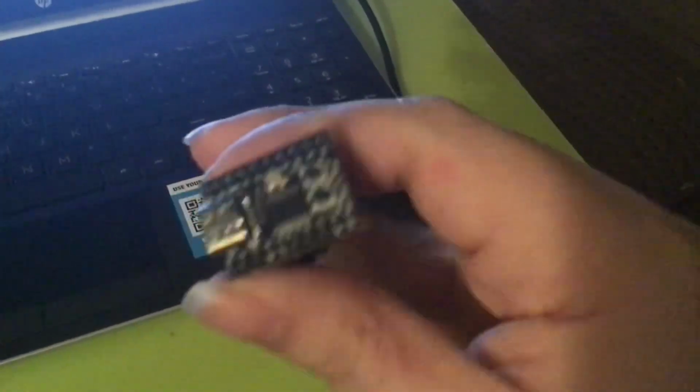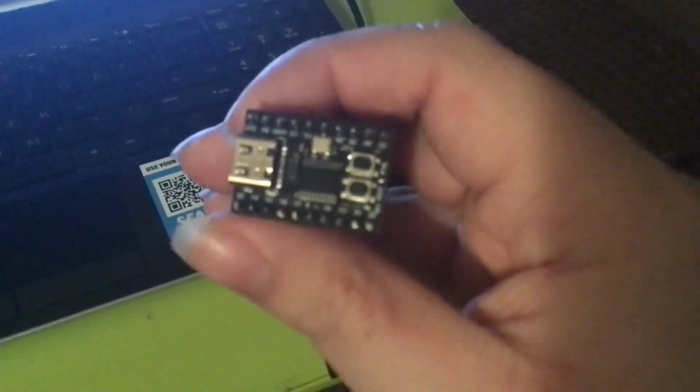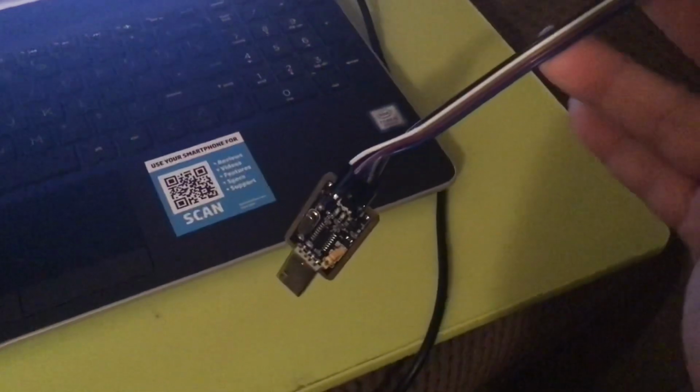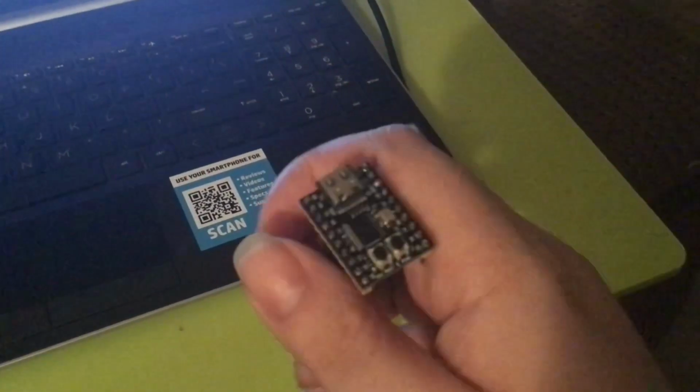But this thing here is even worse. It's kind of a mess, actually. Now, I do not recommend plugging this in using the actual USB bootloader on this. Use an FTDI adapter, it's safer. It won't send weird prompts to the computer and download weird drivers, and you're most likely to get it to work more easily, as long as you get the right wiring.